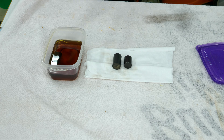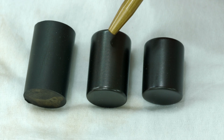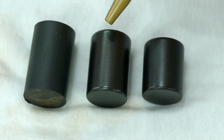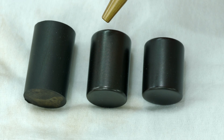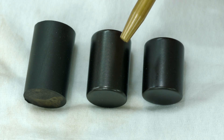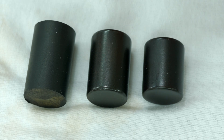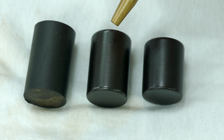This part spent two days in oil — I was out of town. It's a little shiny because I haven't wiped off all the excess oil. To my eye, it's not as black as the reference pieces. Two potential reasons: I may have carded it too aggressively when applying the solutions, or I didn't boil it thoroughly enough.